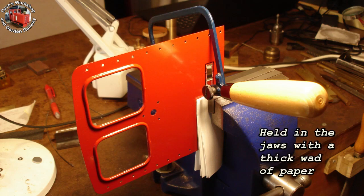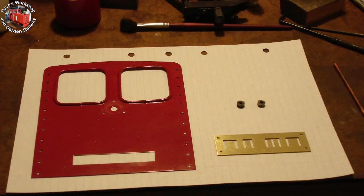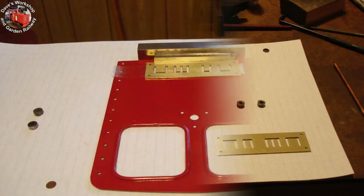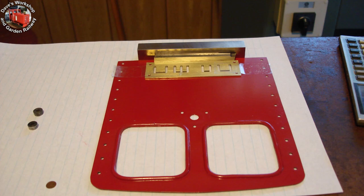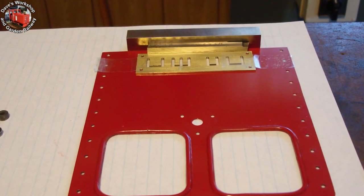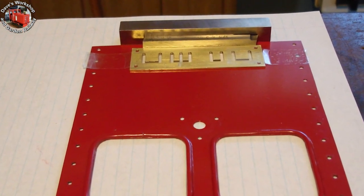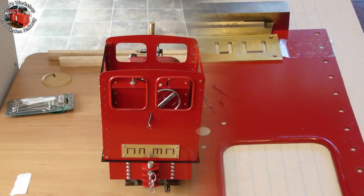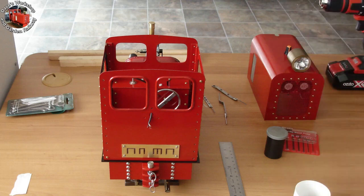Using the piercing saw with a 60 TPI blade to cut a window out of the 0.6mm cab back sheet — prior to this, some 3mm holes were drilled to get the blade in. Smoothed and brought to size by filing. The brass plate was aligned horizontally using the electronic calipers, and then 1/4 inch vertically using a piece of tool steel, then sellotaped down ready for drilling through. The tape held well. As soon as a hole was drilled, I secured it with a nut and bolt. Plate in position, but not the levers — they took a lot of adjusting to get the throws centred.